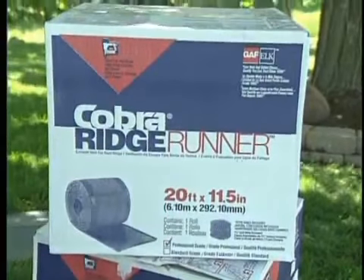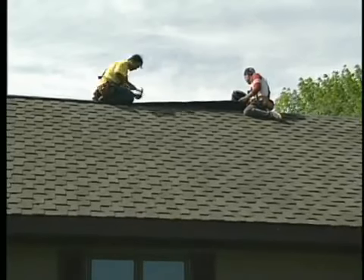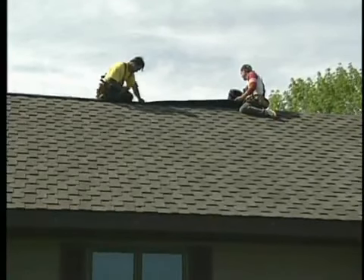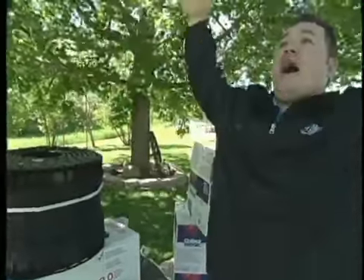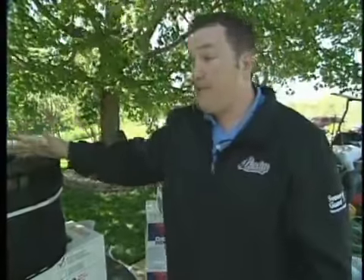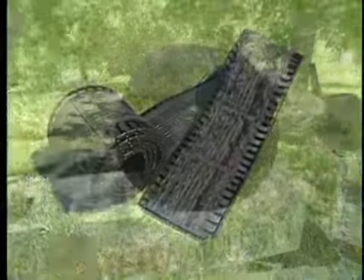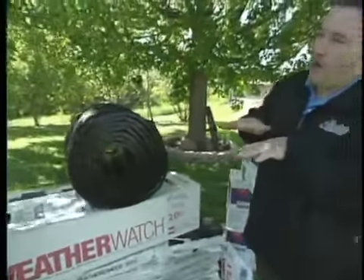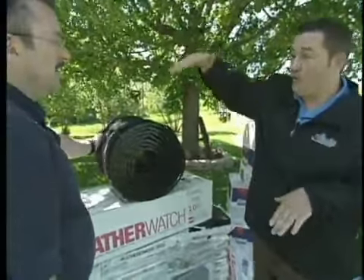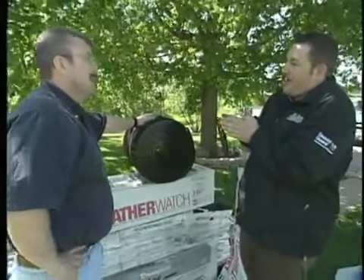What about venting — what are you going to do to accommodate the venting on this home? There are lots of different vents: power vents, turbine vents, turtle vents. My favorite and absolute best is a ridge venting system. That's where the hottest part of your roof is and where all the hot air is going — why not put the vent there so it can get out of the house easily? Now, all ridge vents are not created equal. Most come in four or five foot sections. The problem is they often don't match up properly, going wavy, or somebody cheats a little and leaves a gap — which is an excellent spot for critters to get in.